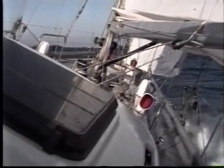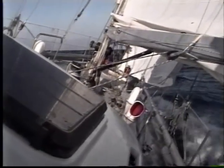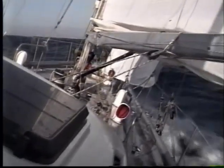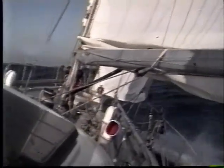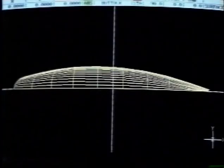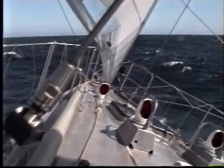As you heel to a gust, depending upon how your hull lines are drawn, there will be more or less of a tendency to head into the wind. If there's a slap by a wave at the same time, it's going to be difficult for the rudder to cope. Sundeer's lines are drawn to minimize the heel-induced steering loads to make her rudder's job easier. Equally important, as she heels, the stern stays in the water, making the rudder significantly more efficient.